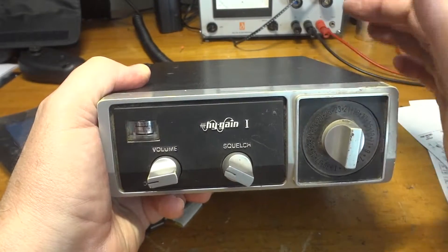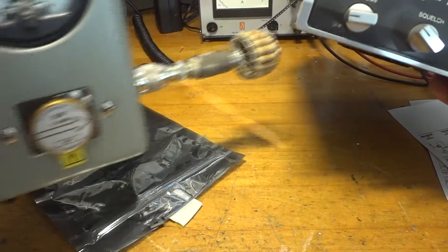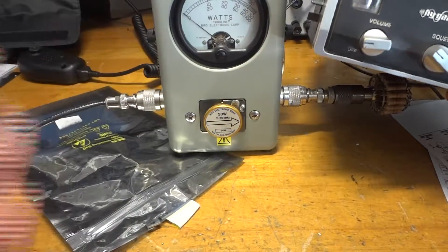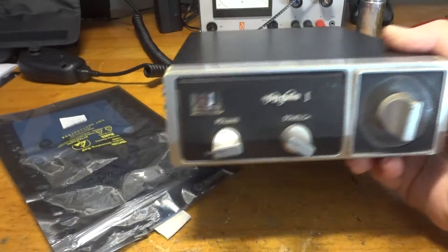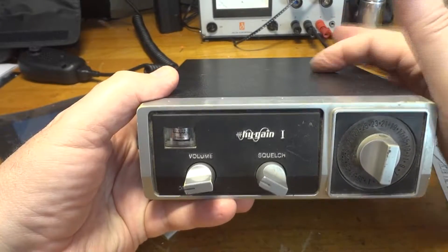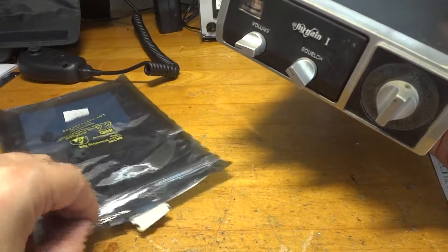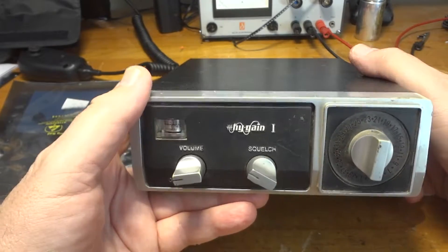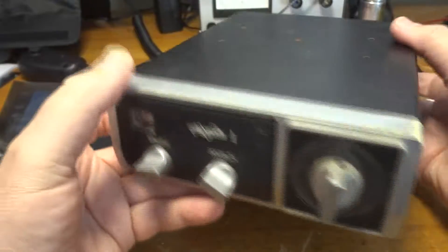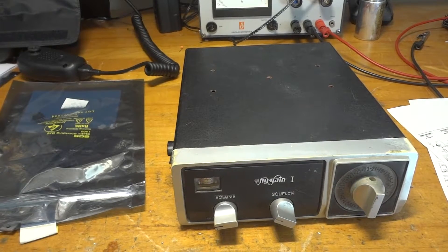What we're going to do is open up this radio, look at the original transistor, and see if the radio still works. We'll use the Bird wattmeter for absolute power measurement and a relative power meter as well. First we'll establish the radio is working, then take out the original 2SC1306 installed by the manufacturer almost 50 years ago, put in one of ours, and see if the output power is the same. If you use a fake eBay transistor you'd find almost no power coming out, so matching power is proof of a genuine 2SC1306.